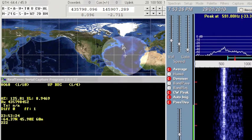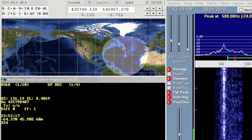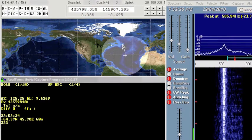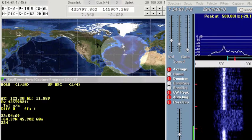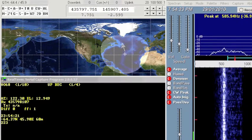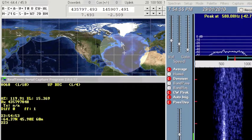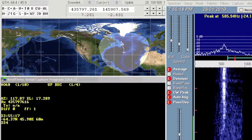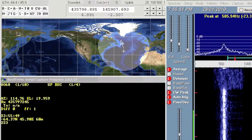You can see that the beacon is being tuned somewhere between 500 and 600 Hz. I'm just speeding up the output now so that you can watch that beacon being tuned over a few minutes' time as the satellite comes a little closer. Every once in a while, you'll see the frequency shift lower quite markedly — that's while the QRP Tracker is announcing.